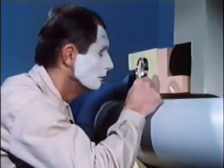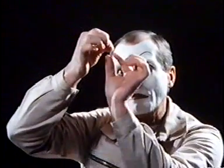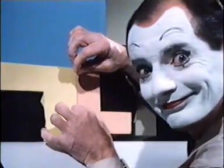Sealing gap? A gap would fill up with fluid. A gap must surely result in leakage. Wait a moment. The seal faces slide on a thin fluid film. This fluid film is hair thin, so that the sliding faces hardly come into contact with each other. The fluid that is to be sealed simultaneously supplies the lubricating film for an optimal sliding motion of the seal faces. That's the answer.